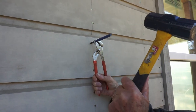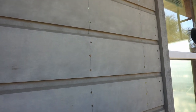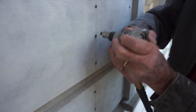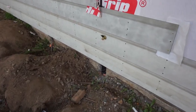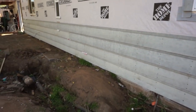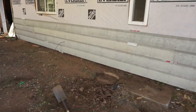I can't hit the nails hard enough by hand, so I'm doing this — it's a good idea, actually my grandfather's crafty way of not getting hit by a hammer: holding the punch with channel locks and then using the palm nailer. This hose bib here is another detail worth mentioning. Before you put the valve on, you've got to poke a hole in the siding, slide the pipe through, then put the valve on the end.